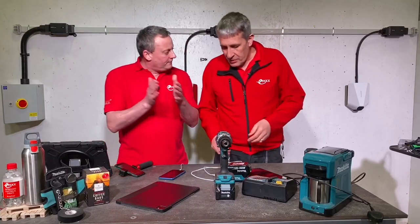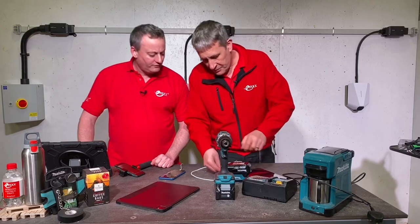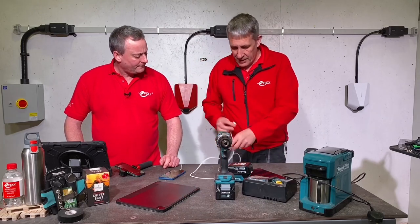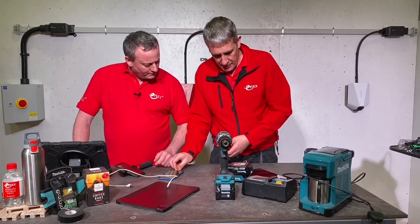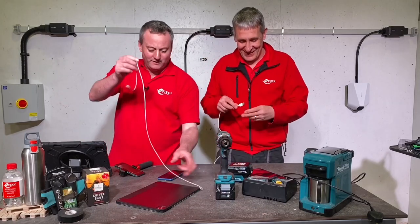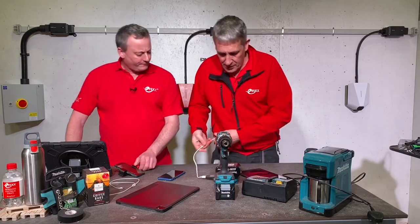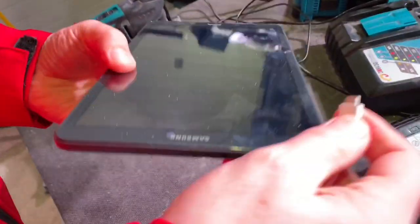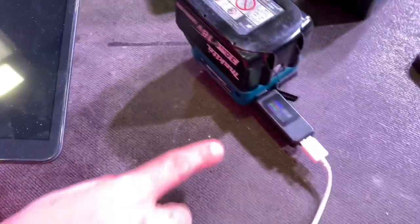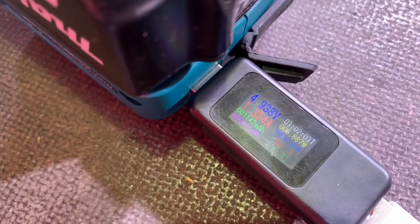So we can do an iPhone, which is good. When we start getting into tablets it starts being a little bit more of a challenge. This is the tablet we use with our Metrel testers — and it's completely flat. You can see that's ramping up: 1.35 amps. Because it's flat, it's doing a little bit more — we've got 1.3 amps. But it is charging, so that's good.